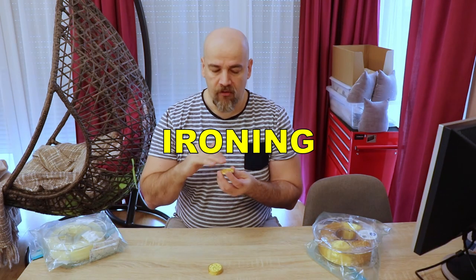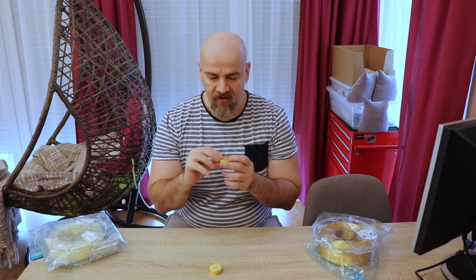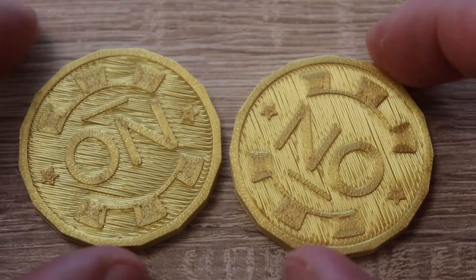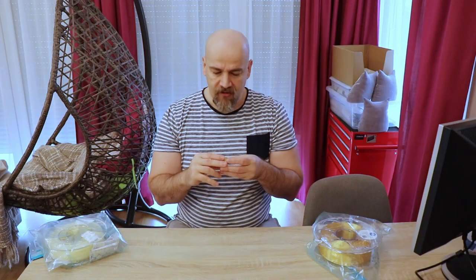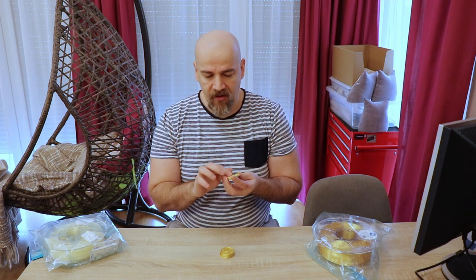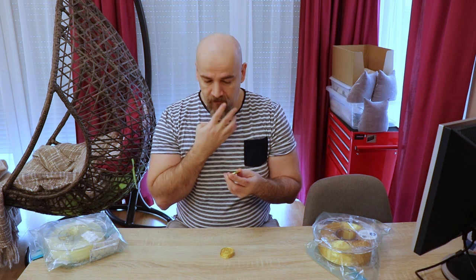The first experiment is using ironing on the top layer, which is a new function of the PrusaSlicer 2.3. The other is to use PVA water-soluble filament to support the bridging on the bottom layers, because this coin has graphics where the letters stand out two layers. It has to start printing with the letters and then cover them with bridging, and this bridging never looks good as a surface. I have several of these coins and I like to give them as a small gift when I don't have change for a tip. People really like them, but they usually notice that the background of the 'no' side is quite ugly compared to the 'yes' side because this bridging never looks good as a surface.